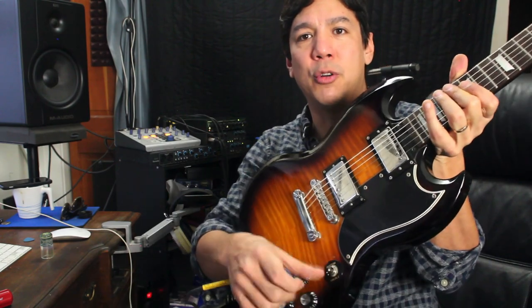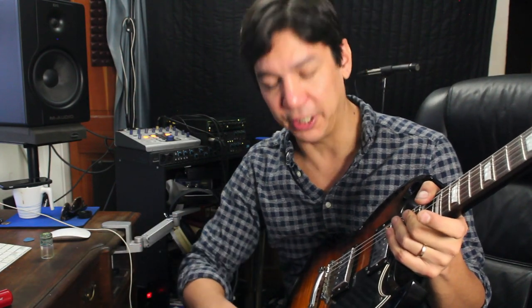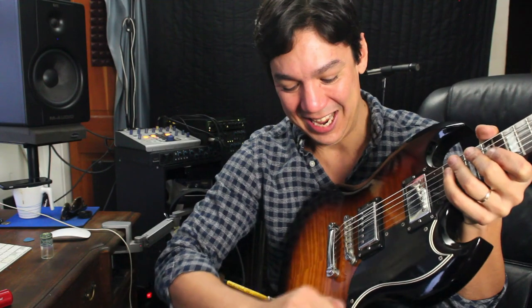The switch is a little scratchy. If you have one of these switches, this is a pretty normal toggle switch — you find these on lots of guitars. When switches go dirty, you can do two things: you can get your contact cleaner out, but most of the time if you just toggle it a bunch, that will scratch all the gunk off the terminal and clean it up.